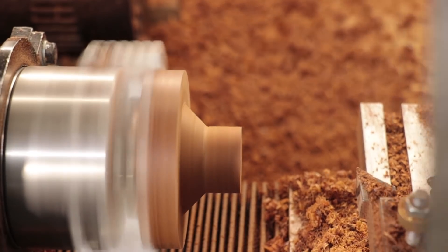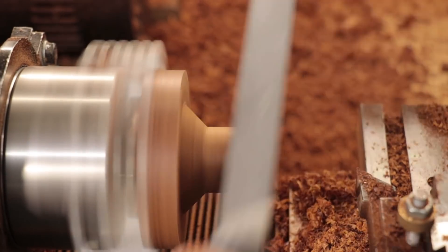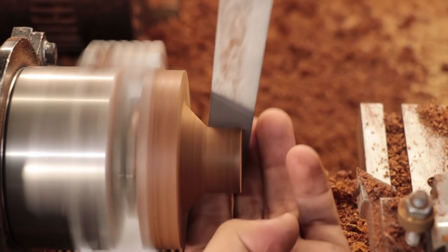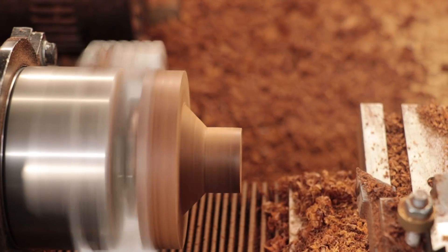With the file I'm going to go in and add a slight taper to the part. This draft angle is pretty slight, only about one or two degrees, but it should help me remove the part from the mold.